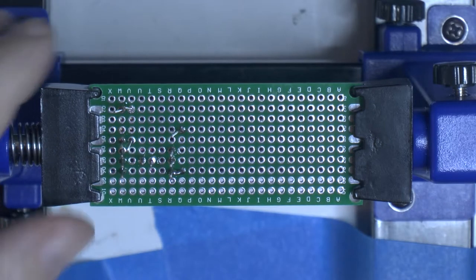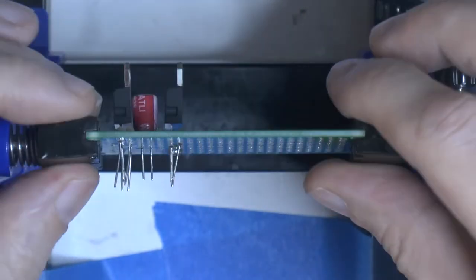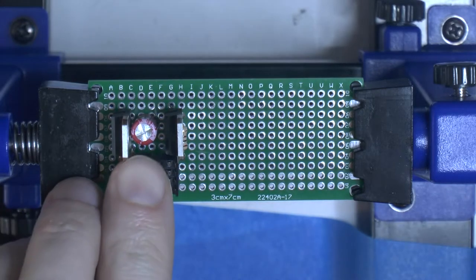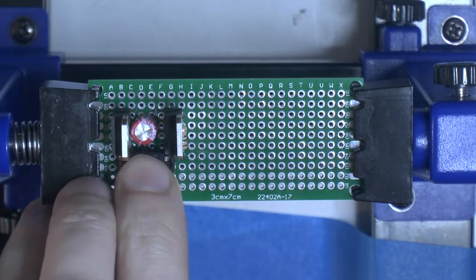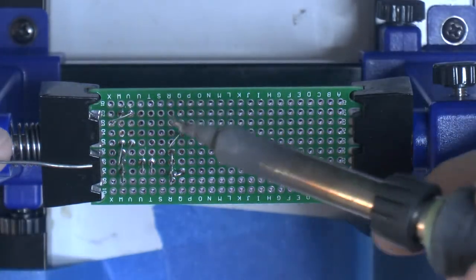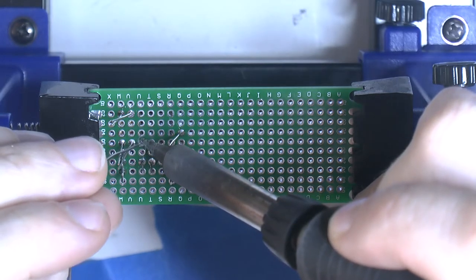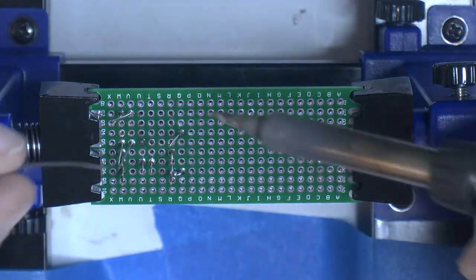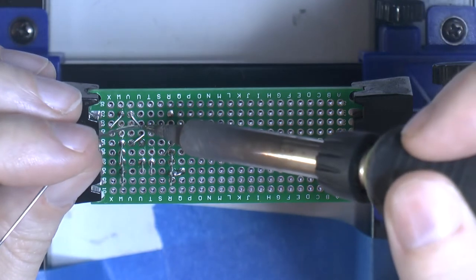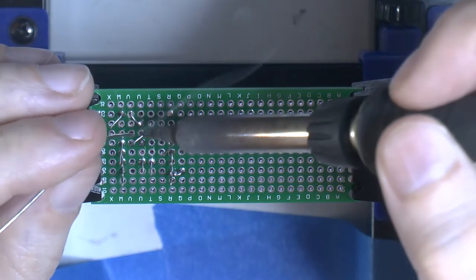There are screenshots of both the schematics and the layout for the breadboard and the wiring so you can just look at those. There's also a mirrored version so when you solder cables on the back and twist the board, you can quite easily follow the wiring. Now I'm adding a DIP socket here — it was actually quite cheap to get them with the 555 timers. I bought 25 timers and for like an extra euro I got 25 DIP sockets too. The nice thing is if your chip dies you can quickly swap it out instead of trying to desolder it.